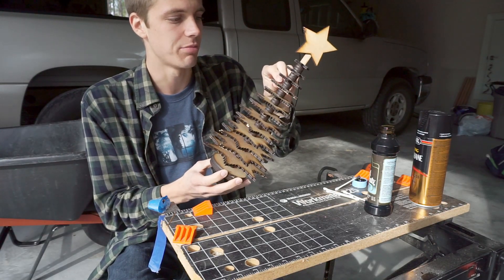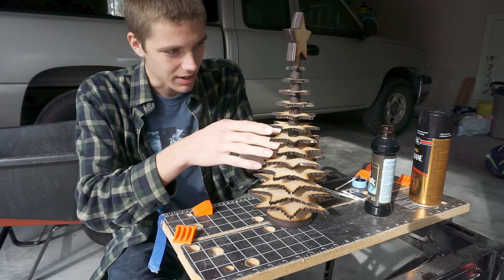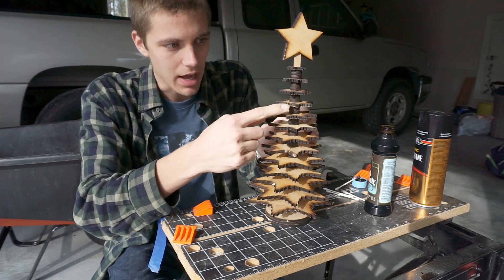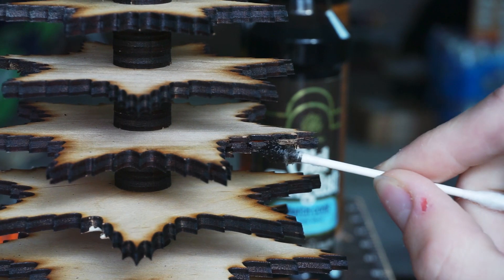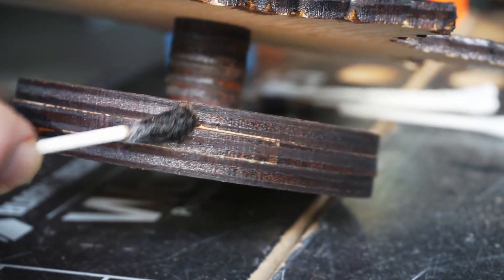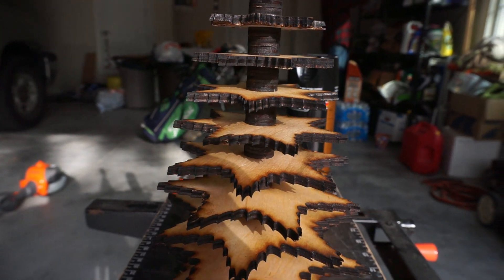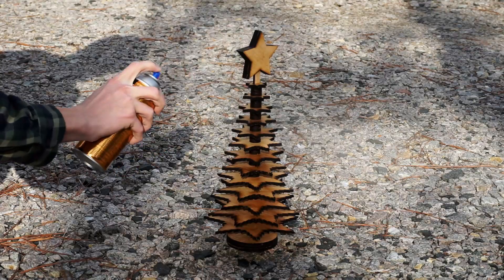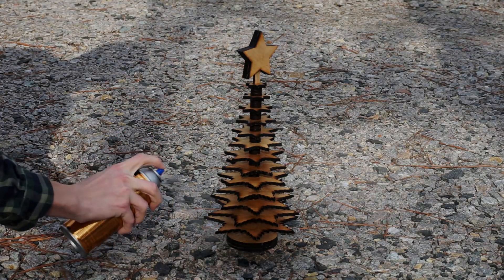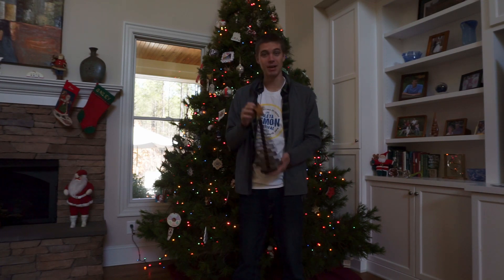Along the edges of the tree there are a lot of places where the laser didn't cut all the way through the wood, which meant I had to sand and clean up a lot of the edges. That means a lot of these tree limb edges are light at the bottom because that's where I had to sand away the char. So I'm using scratch cover polish to artificially darken all of those spots so the edges of all the pieces look the same before it gets polyurethaned. Once you wait a couple days for the polyurethane to dry, it ends up looking really nice. It's not a real Christmas tree, but it makes a great decoration around the house.